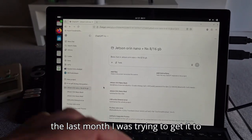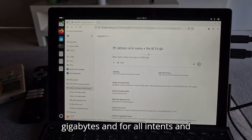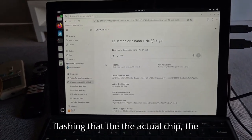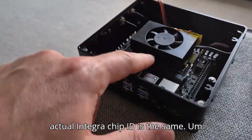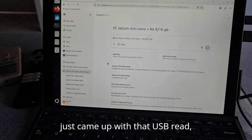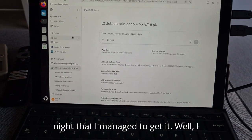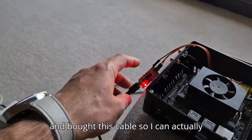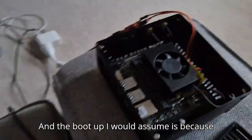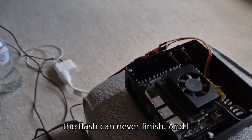During that process, for the last month I was trying to get it to flash. The NX board has 16 gigabytes and for all intents and purposes it's exactly the same — I used the same chips they used on those modules. I found through the flashing that the actual Tegra chip ID is the same. But the manual flashing ran into blocks or gave USB write errors, which are quite common on Jetsons. It was just last night that I managed to get somewhere. The UART would show the board rebooting during flashing and then failing the alias check, so the flash could never finish.